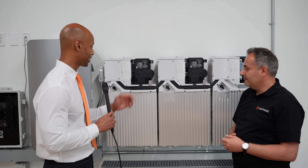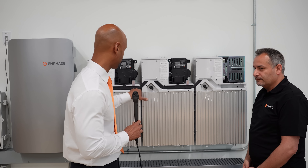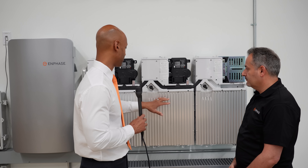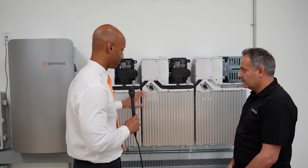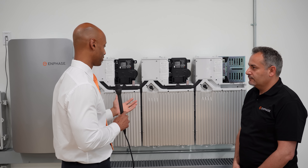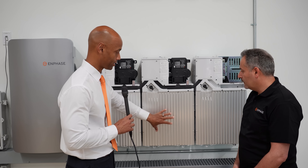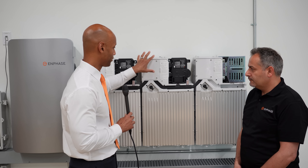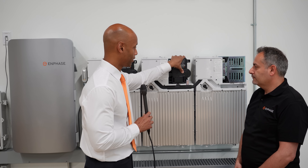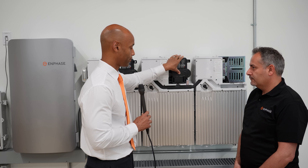So with the cover off, I can see three distinct battery modules connected by this daisy chain — basically three separate batteries, parallel connected, that look like one battery appliance to the rest of the system. But really, what we keep calling a battery is actually an energy storage system that includes battery storage — the lithium iron phosphate cells behind those heat fins — a battery management system, and an inverter-rectifier. In this case, you're using four individual IQ8 series microinverters per battery module to do the inversion and rectification.